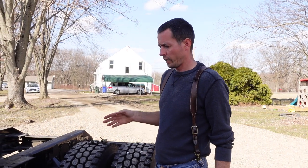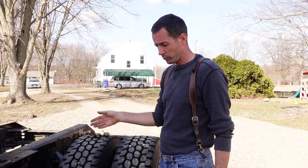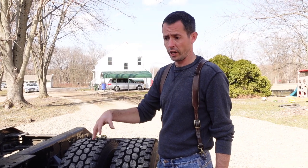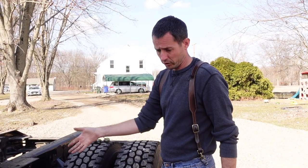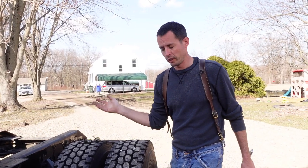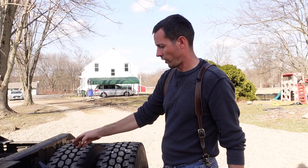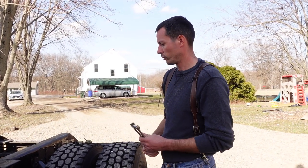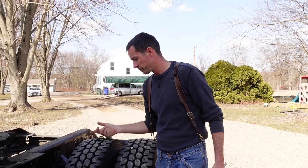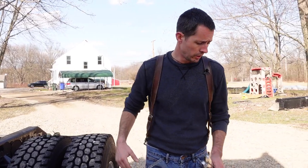All right, so I had to go ahead and reapply the parking brake, because if not, when you take these lines loose, you're going to have air. There's air there holding that diaphragm open, but obviously this situation is not doing anything anyways. So I went ahead and reapplied the parking brake so we don't have air at that emergency or parking side. And I'm going to go ahead and take those two lines off. Once we take the two lines off, we're going to take the torch and cut that clamp off and just let it drop.